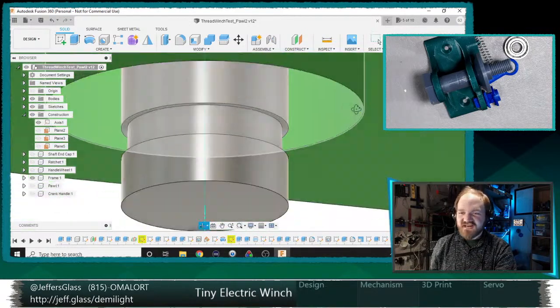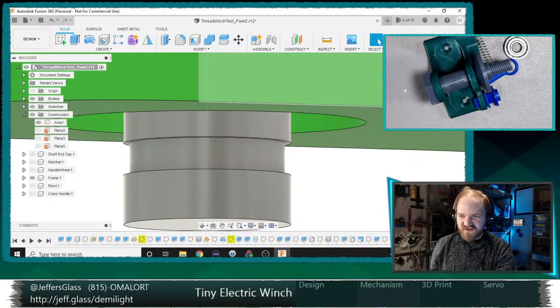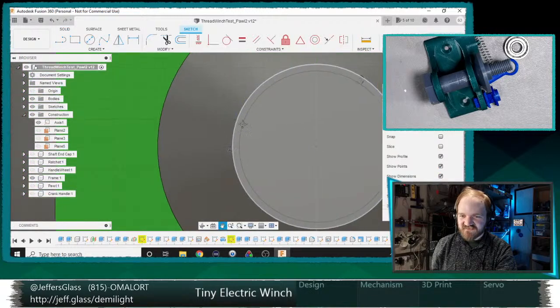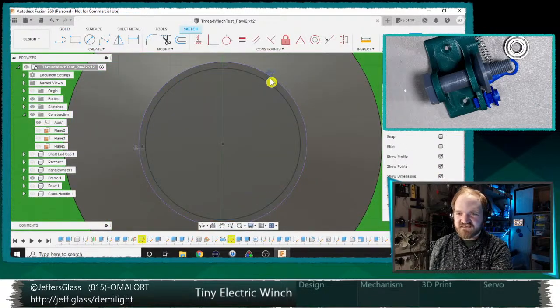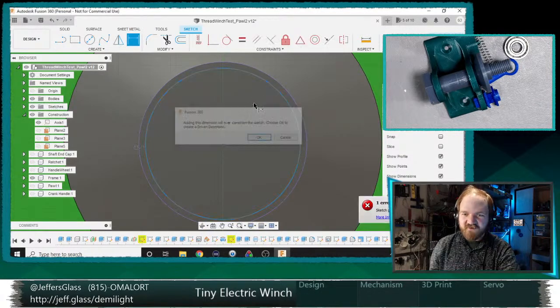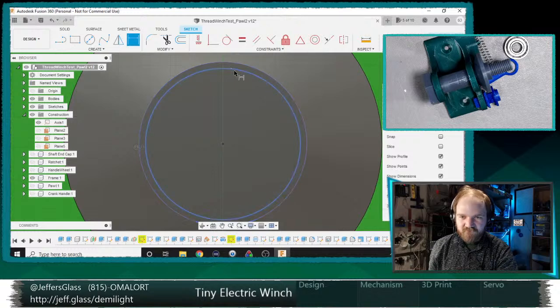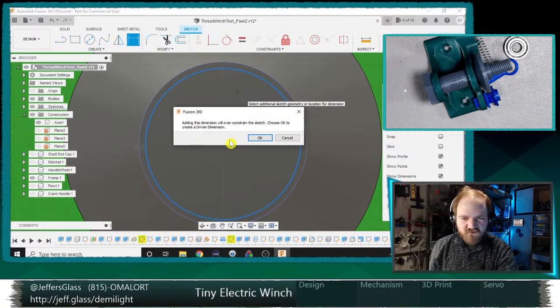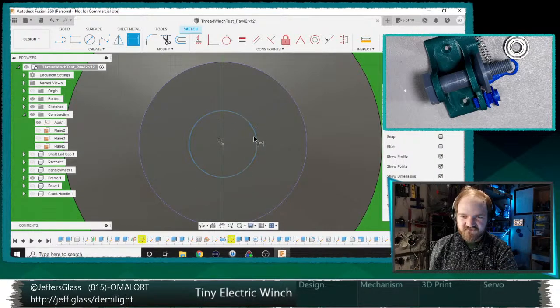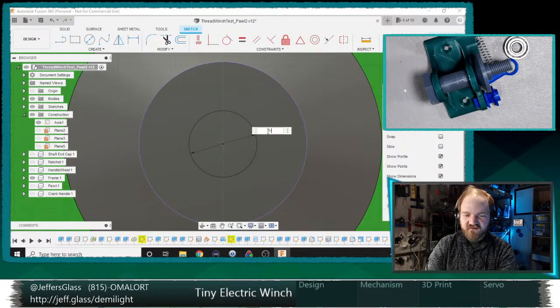Retaining clip is, I guess, what I was trying to think of. E-clip. Now that we have that as a possible diameter, instead of doing this as an offset, let's do this as a proper diameter, where we say that if this is a 5/16 nominal clip, that this in... Now, why? That's not a driven dimension. Maybe something was constrained that shouldn't have been.